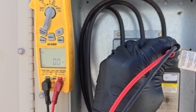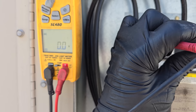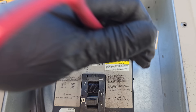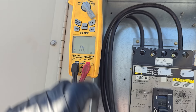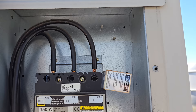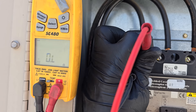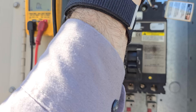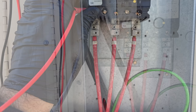We're grabbing incoming power — zero volts, checking across the phases, zero, two volts, nothing. So we have no power. Next thing we're going to do is test to see if we have any direct shorts to ground. Using the audible tone because we're looking for a major direct short, not doing an insulation test. We've got an audible beep and a green light. Testing from each leg to ground — nothing. Making sure there's no direct short to ground before I go downstairs and reset the tripped circuit breaker.